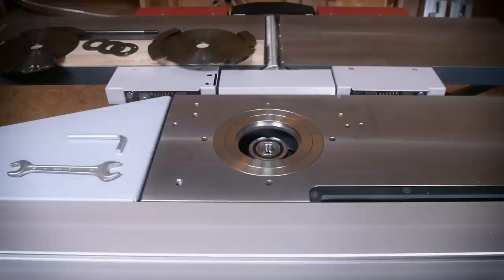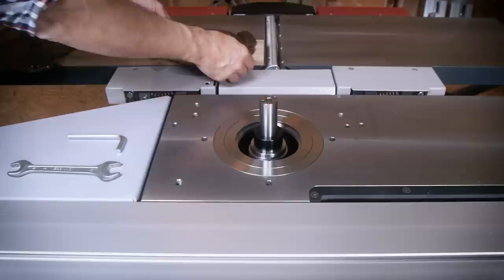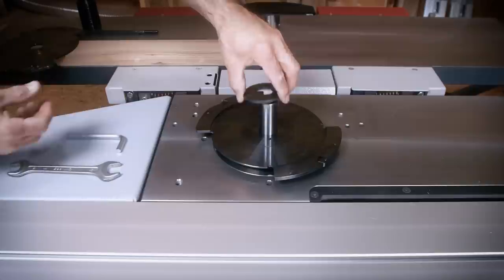Obviously, our C331 comes with a fully fledged milling function. An adjustable slot cutter with a diameter of 250 millimeters is mounted. The shims are placed in such a way that a slot of 12 millimeters can be milled.